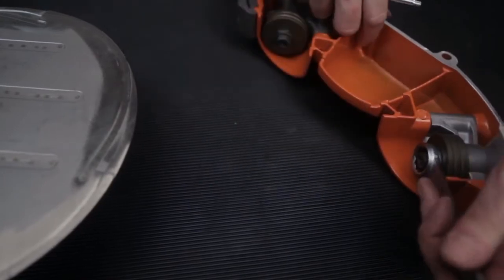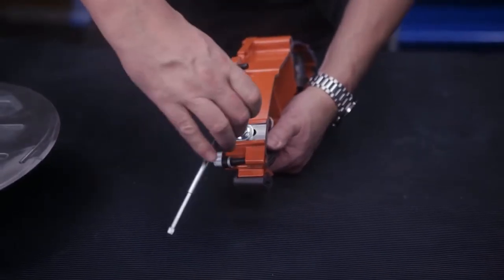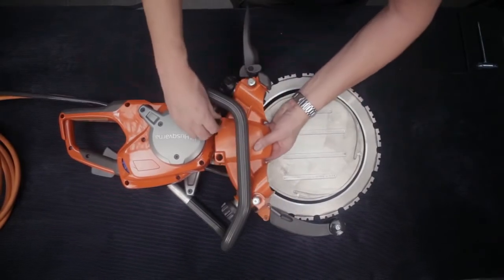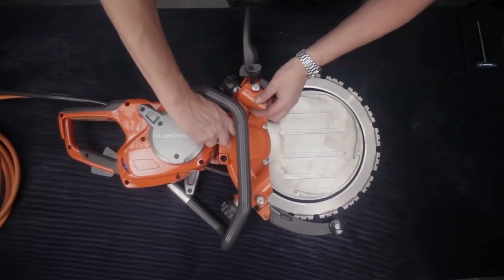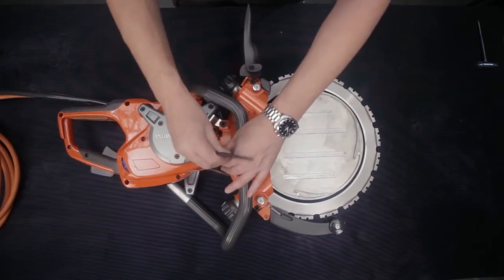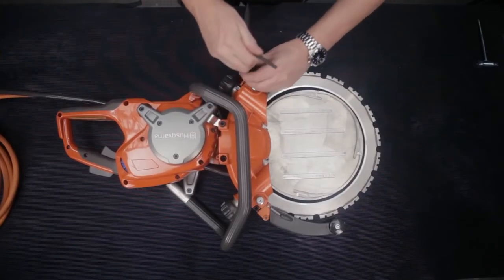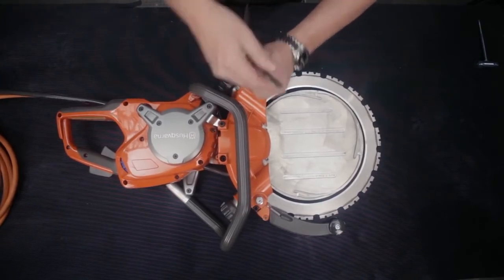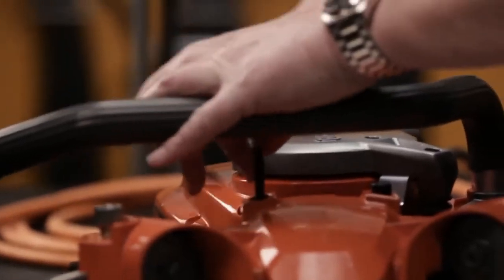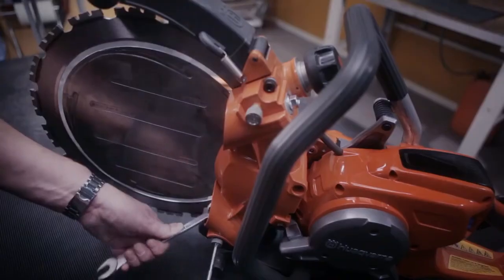The new engagement and support rollers' diameters are greater than those being replaced, so you'll have to loosen the adjustment screw by about 4 turns before fitting the cover, if both engagement and support rollers are being replaced at the same time. Once you've replaced the rollers and fitted the blade, you will of course have to adjust the rollers.